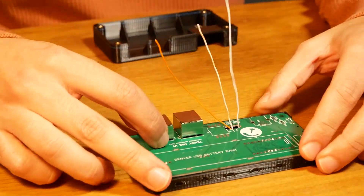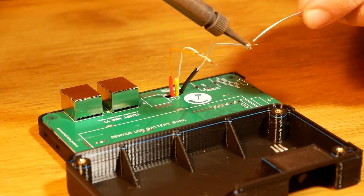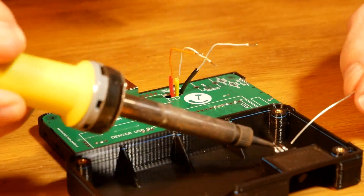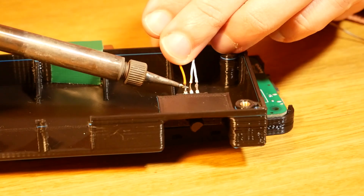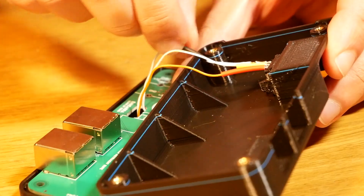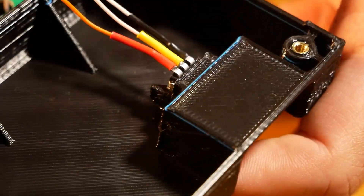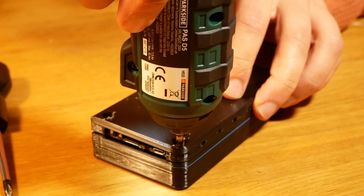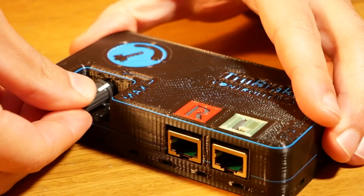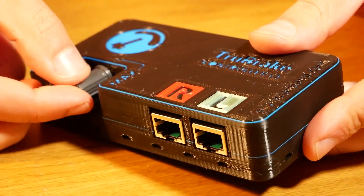We have the bottom case, and I had to wire up the potentiometer before closing the box. I ended up using a little bit of heat shrink — even though they probably shouldn't move — just to make it all a little bit neater and color-coded. I closed the box with the screws on the threaded inserts, put the cap on the potentiometer, and the main unit is done.